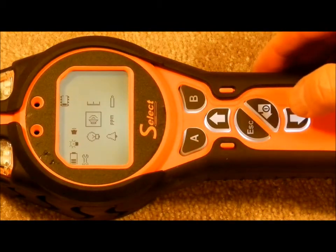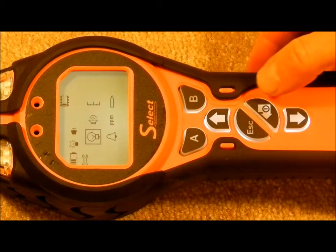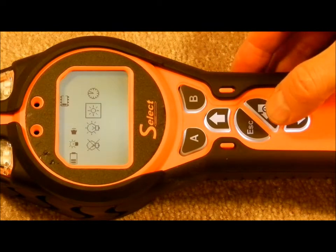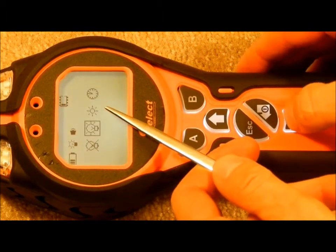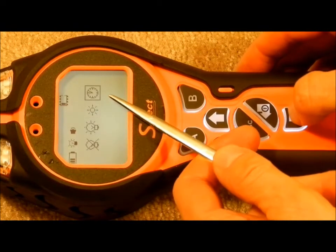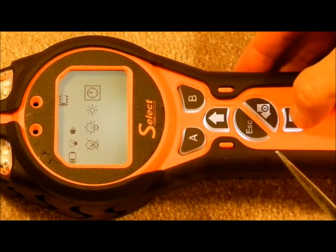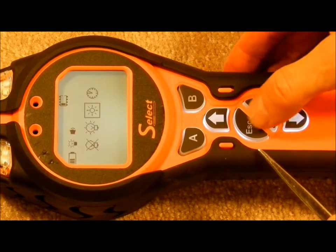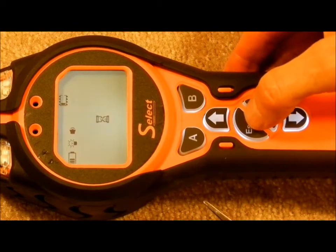To move between the selected items, press the up or down keys. For example, to enter the backlight mode, press the enter key. Now we have a choice: backlight off all the time, backlight on all the time, backlight on when the unit is moved into the dark, and backlight timed. Note that ESC saves the changes made and does not ignore them. So if you want the backlight latched, highlight that item and press ESC to return to the previous menu and save the changes.